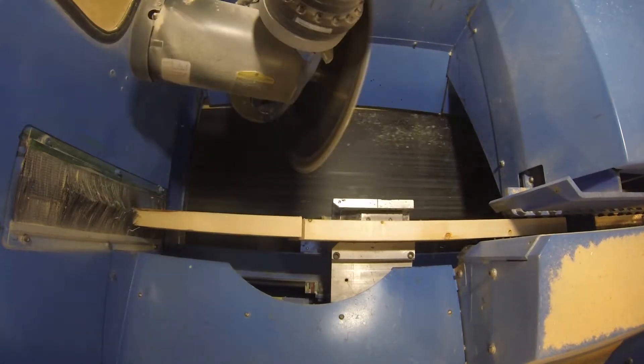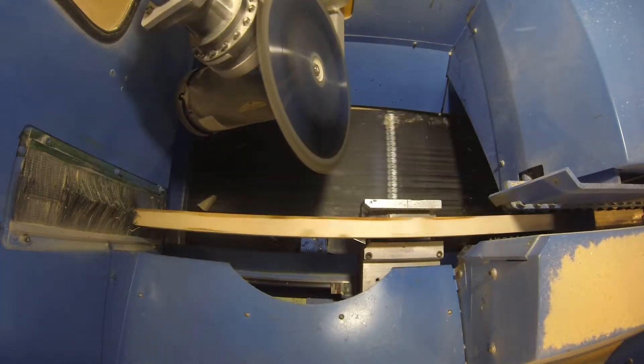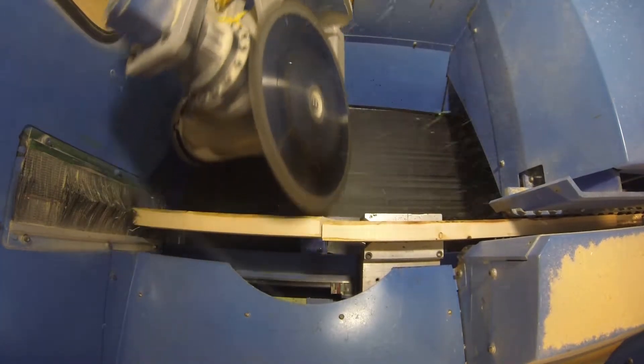The angle axis should usually be calibrated before any other axis. It may be the only axis that needs calibration if the angles of cut parts and pitch on scarf cuts are inaccurate.